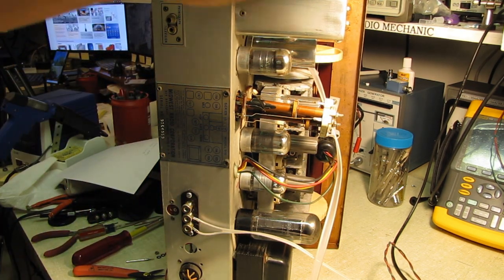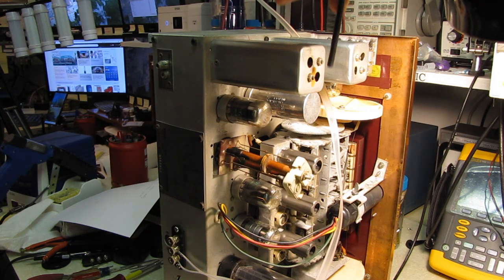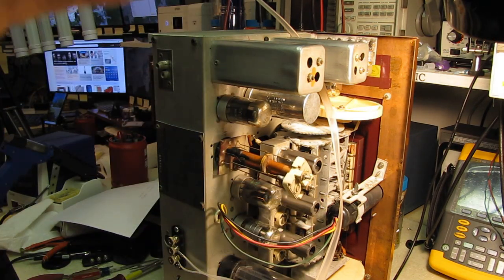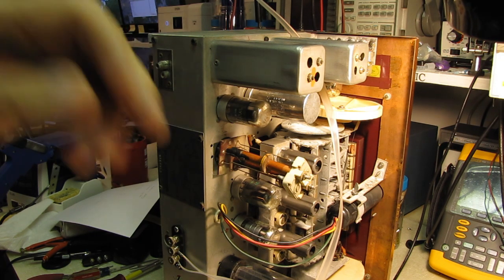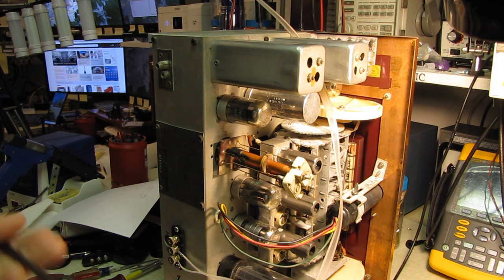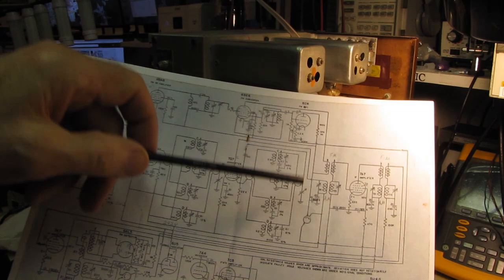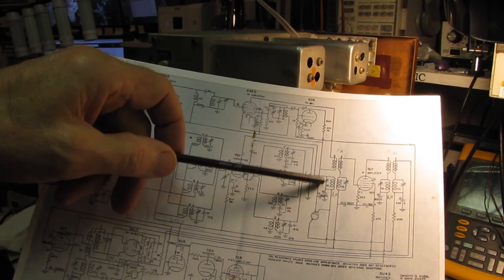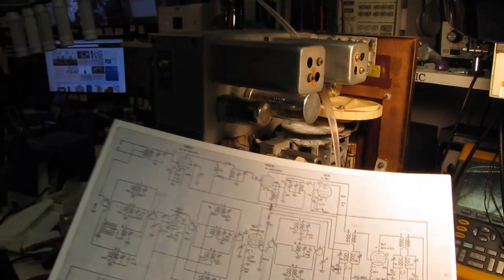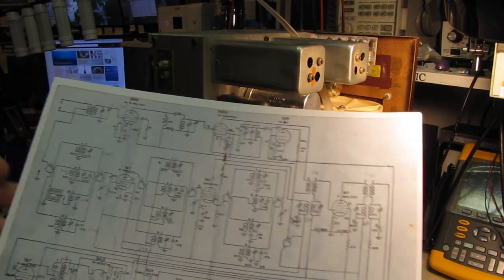A word of warning when you're tuning, and I've said this before, but I think it bears repeating. These capacitors that are accessible through the top of your can, I've tested these. These are cold. About 30% of the sets I work on, these are hot. These are live at B+. So there's a shock hazard, but the bigger hazard is your anode supply for your IF amp and your converter run right through that coil. And if the top part of this capacitor happens to be the part that's hot, and you short that screw to ground, you can blow your IF transformer, burn it right out. So you've got to be real careful.